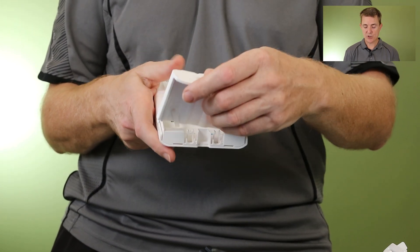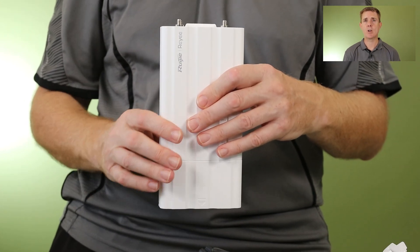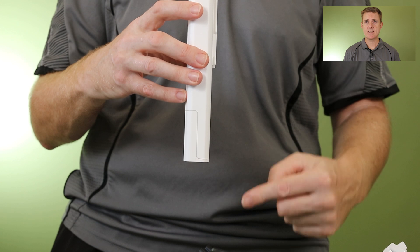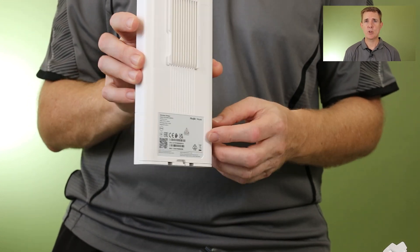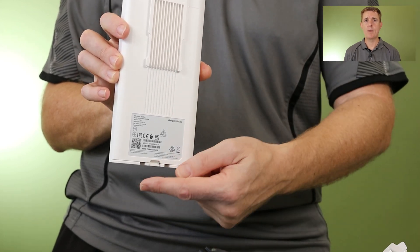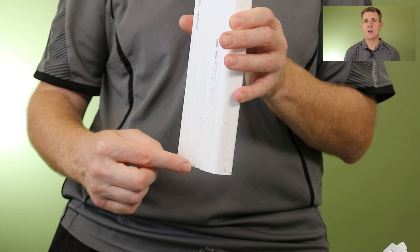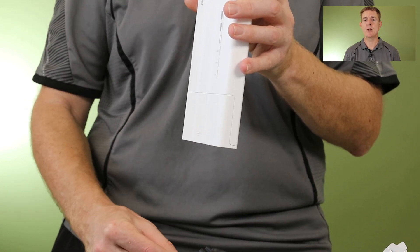The cable runs up, and just to remind you these are outside-suitable because of how far up the cable goes. But you always want to do a drip loop. What do I mean by that? Say our cable came in from the wall — it needs to come down below the device and back up again before coming in. So the cable comes in, goes down, loops up, and then comes out. We want to make sure any moisture, rain, or water that comes onto the front will always drip down the cable, reach the bottom of the loop, and then drop off.